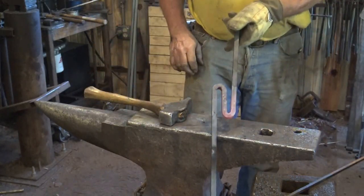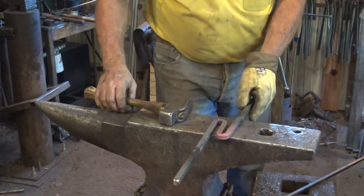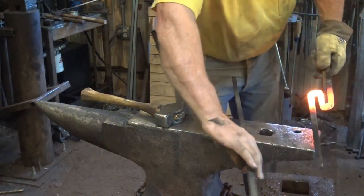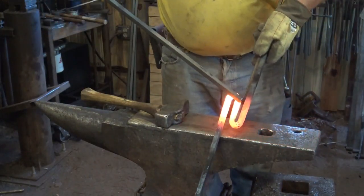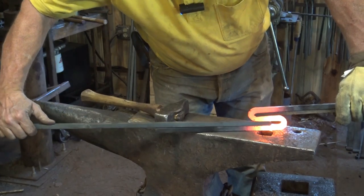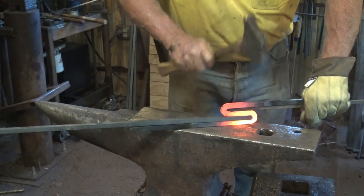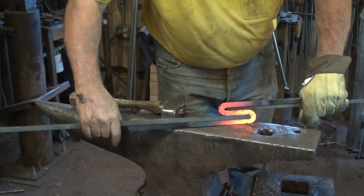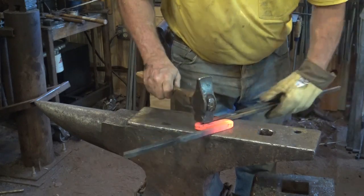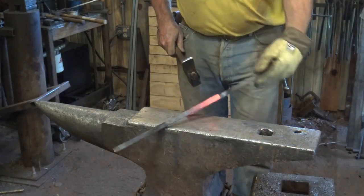That's the basic twisting wrench. The handles are a little bit wonky so I'm going to get that hot again and see if I can get everything straight and in line. You can see how it's not quite touching the spacer — that's the problem right now. You want to make sure you don't close these up so far that you can't get the material being twisted in. It's a little bit of an uncoordinated process there, but it does work.